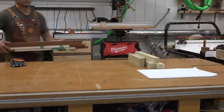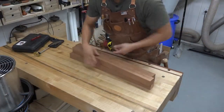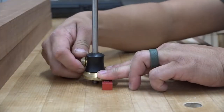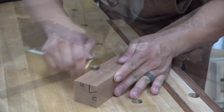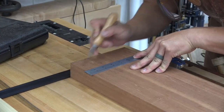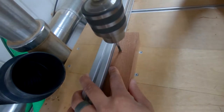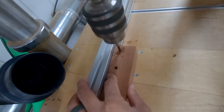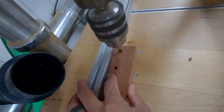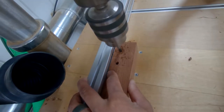Now it's time for joinery. I'm using mortise and tenon to join the aprons to the legs, and I first lay out the mortises using my marking gauge and a setup block. The cutting edge of the marking gauge gives me a really consistent line that I can bury my chisels into. I always reference off the same face of each part during joinery layout. I use a planing stop to reference off the top of the legs to mark the shoulders of the mortises. To machine the mortises I'm using a quarter inch Forstner bit at the drill press, drilling the bounds of the mortise and allowing the waste to clear before plunging to full depth for a cleaner hole. Setting up stop blocks along the fence of the drill press table would have made this more repeatable — a lesson for next time.